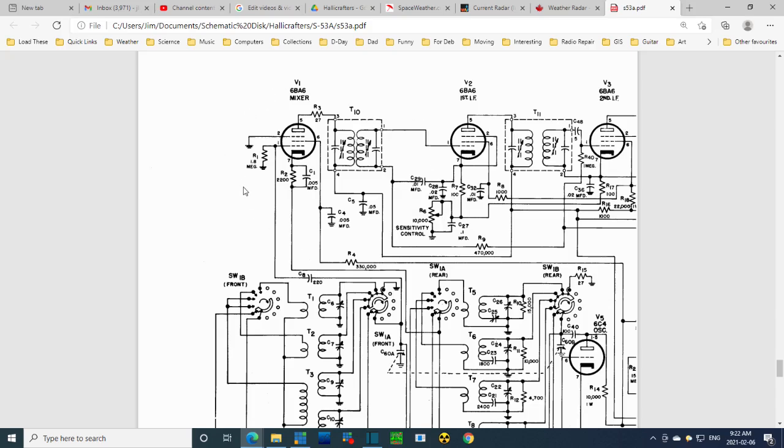After the mixer, all you've got is 455 kHz continuing through the radio - everything else has been rejected or suppressed, and that suppression continues through each tuned IF stage. I replaced this capacitor here - what's it doing? It's providing a ground at the bottom of the coil from an AC or signal point of view. If this is weakened, the coil will operate weaker and probably be off frequency as well.